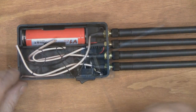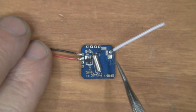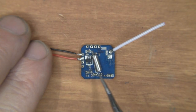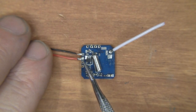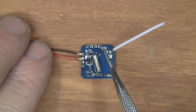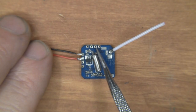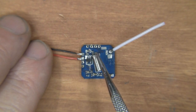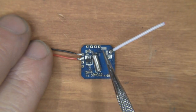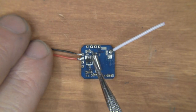This is one of the AV transmitters I bought a batch of probably getting on for two years ago — really simple. I'll put a schematic and wiring diagram in the description below. You've got your two power wires coming in, and these two solder points where you can actually add audio and video to transmit. You've got four holes used as jumper points so you can put jumper wires in to give you the different channels — one, two, four for instance. One channel on this AV transmitter actually blocks three channels on the Wi-Fi.